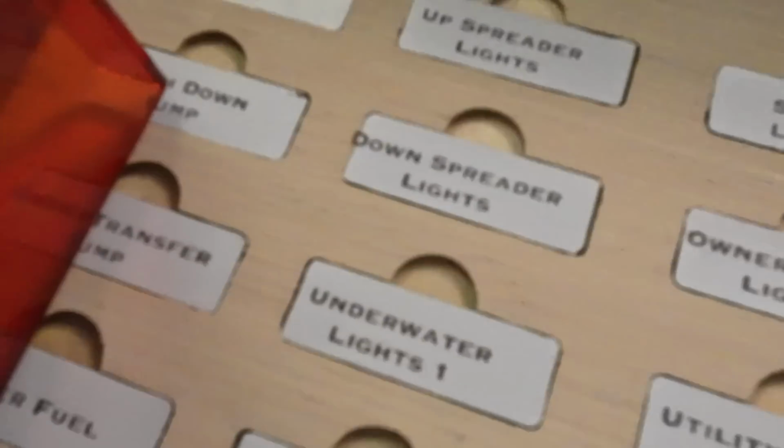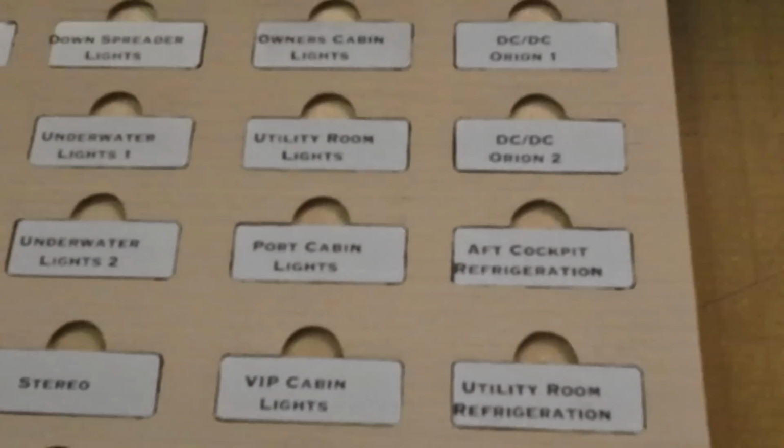All right, so we got some wins and losses on this guy. The win was, I figured out exactly what I want to do, and all of the breakers are now put in their position. I think that's the final spot where they're going to be. The downside is that although the labels are cool, they just didn't turn out quite like I wanted them. The reason is I had to cut it on two different machines. One, I had to cut the labels with the CNC because this is ABS material, and lasers cannot cut ABS. It just melts and froths and looks really nasty. Number two, I then created a tray to put these in to be able to cut them, and between transferring the files, they were just a little bit off. So not all of my stuff is as crisp as I would like it.